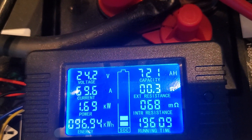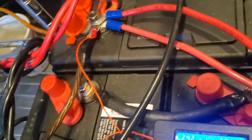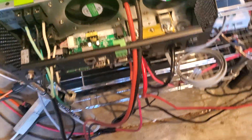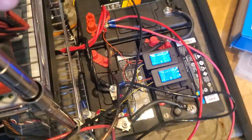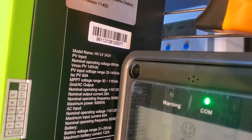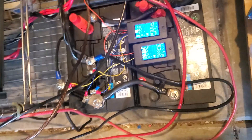I don't really see anything more than 70 amps out of this no matter what, so I feel my wiring is pretty sufficient. It's all 6 gauge or larger as far as the charge controllers are concerned. The inverter has what it came with, basically two 5-gauge wires on each side. They recommend using two 6-gauge wires or something like that — the ampacity of some 6-gauge THHN wires in free space, not in conduit, is over 80 amps. This thing is capable of pulling about 132 amps, but it will never do that with my current load. I'm going to get some different wire for this later on.